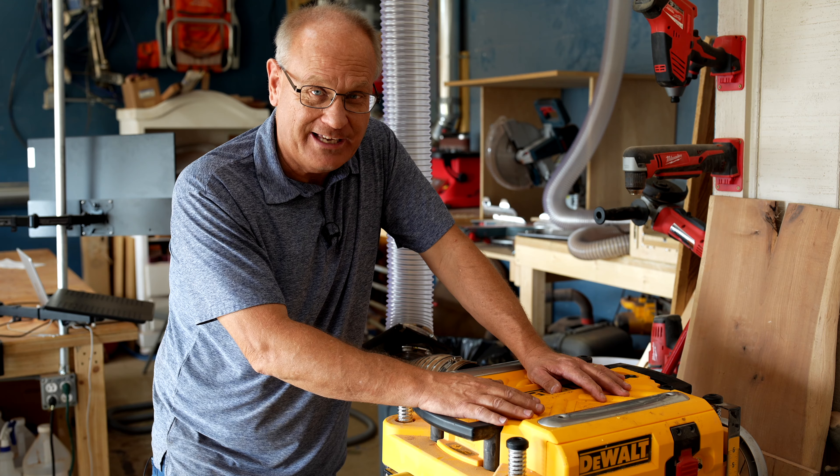That's back on. Now all the chips come up through here, the fan sucks them through here, and the blower shoots it out the back. Now it's time to replace the top cover - line that up on both sides, get it down in there, and tighten them all down. I get these loosely snug first, rotating side to side, then tighten them all down in an X pattern. I'll snug each one down - not too tight - and then do the final tighten.